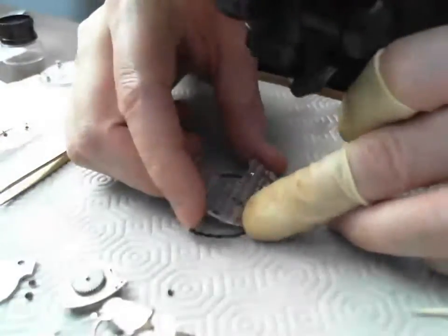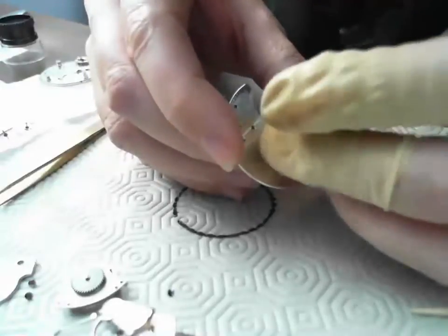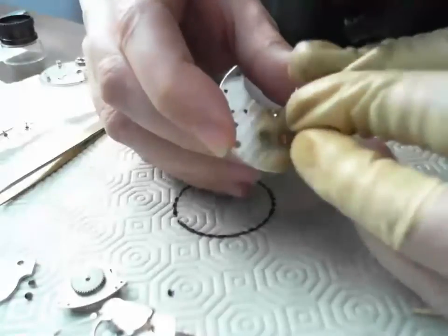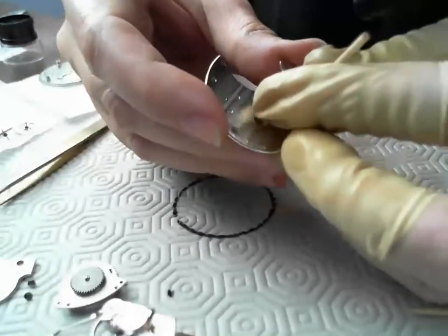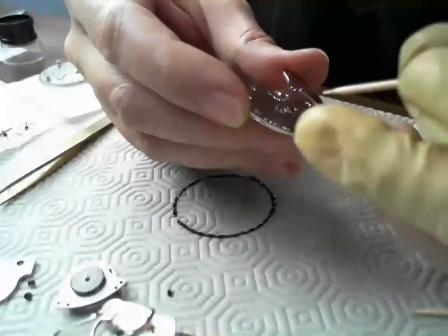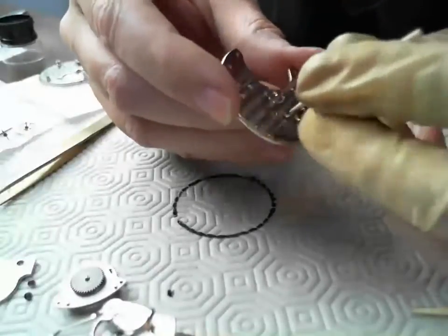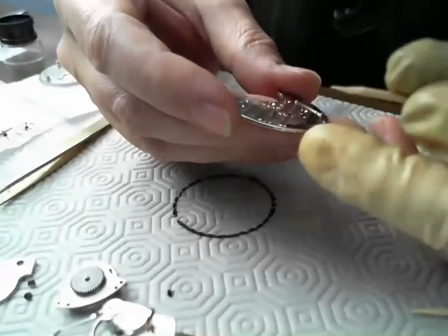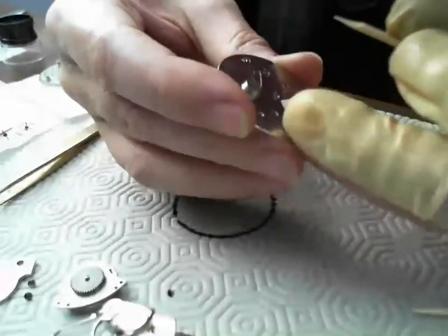Now I have to make sure the memory's going. I believe I've pegged these holes out already, but I'm just going to make sure I've pegged them out here. So there's no issues remaining. This one needs to be pegged out. You can actually see a little bit of something on that one. And then this one is capped, but I'll peg out the jewel hole anyway. So yeah, that is one small hole in there. Yeah, that's nice and clean actually.